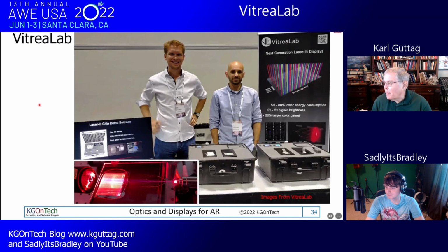I wanted to bring these guys up. This is kind of neat, and I don't know whether this makes a lot of sense or not, but I found it interesting. People, the holy grail for LCOS would be to be illuminated by lasers. Now, you still got the interference issue we talked about earlier with laser beam scanning, but in some ways you get all the benefits of LCOS. You get this kind of focus-free nature. You get really high efficiency relative to the light source if you can illuminate with lasers. What these guys have, this is VitreaLabs or somebody, they're in Europe someplace.